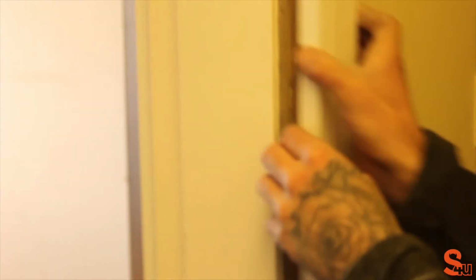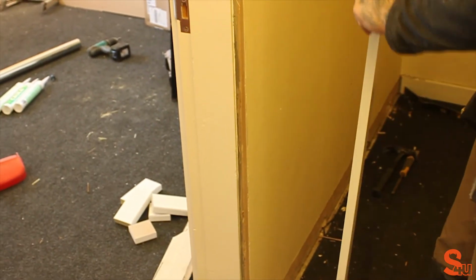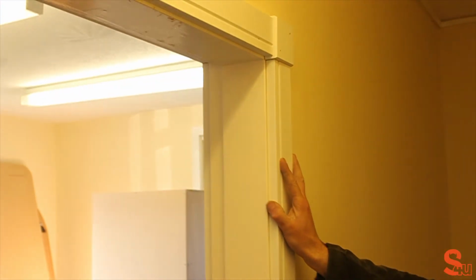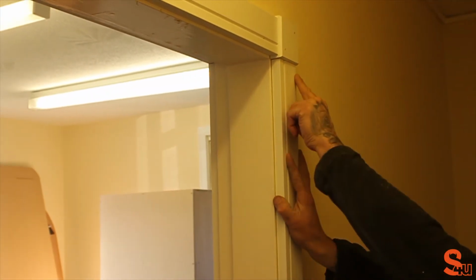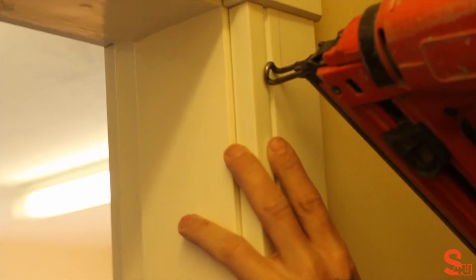Okay, put the piece up to the 5mm guidance line. Hold in position, make sure it's centre of the rosette and centre of the plinth block, and then fix into place. And once this piece is fitted, that's the final step, and you've now got plinth blocks and rosettes fitted.